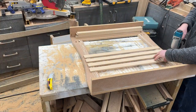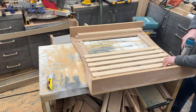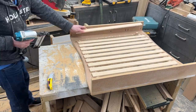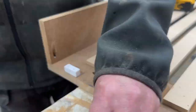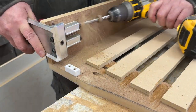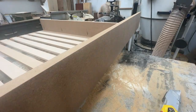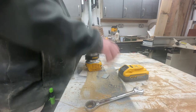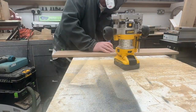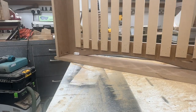This project is quite quick and simple — in total there's probably about two and a half hours in these three radiator covers. Not a big build by any means, but just something a little bit different to show you don't always have to work with high-quality wood to get a good finish. Next I'm prepping for the top, putting in some pockets and chop blocks to screw the top on, making sure the width doesn't cause a sag. I put a round-over top and bottom on the shelf and give it another quick sand for the painter.